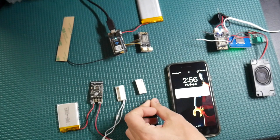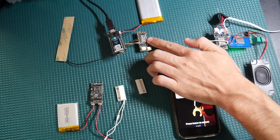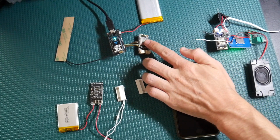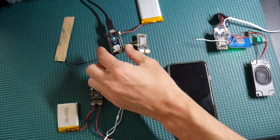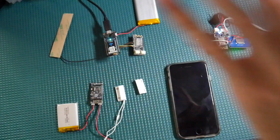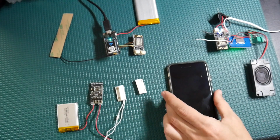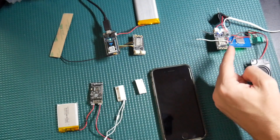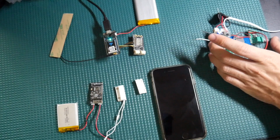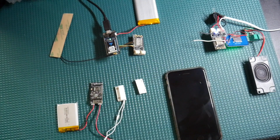When you open the door up, it sends the ESP-NOW packet directly over to the ESP8266 at the gateway. That passes the data along to the Particle Boron cellular module here, and then up to the Particle cloud it goes, where we send out the push notification to smartphones as well as the MQTT data down to the monitor. So a lot going on there, but in this video all we're going to talk about is the cellular module. So let's go ahead and get started.